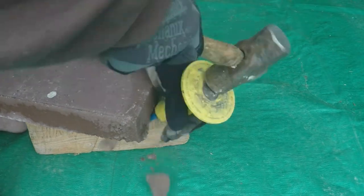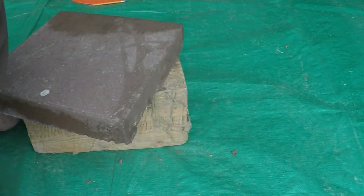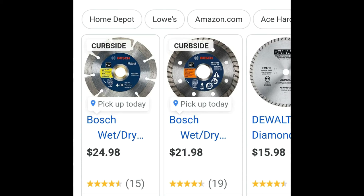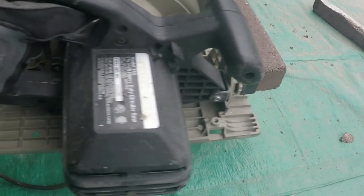Let's try to fix these things. If you try to knock the lip off with a brick chisel, you'll find that it will do considerable damage to the backside of the brick. Let's try something different — head back to the store, preferably not Home Depot. You can buy special blades coated with diamonds that'll go on your skill saw and can cut concrete. This option worked rather well, actually.